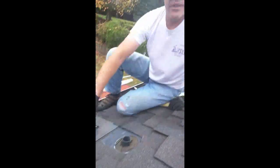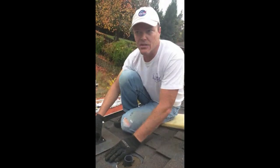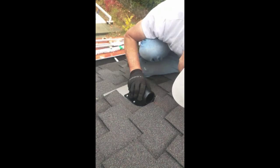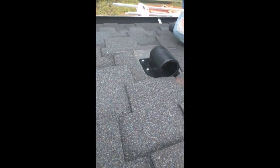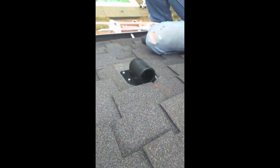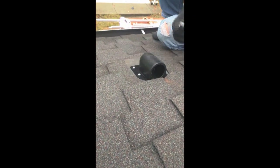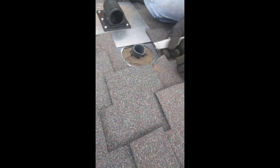On the other two I only had to pull out two nails to get this to work. If I'd pulled out the whole flashing there would be at least six, possibly eight nails. It won't quite go all the way up because I have to cut around this roofing material a little bit, so I'm going to go ahead and cut straight across here.